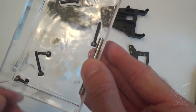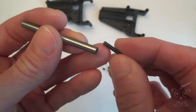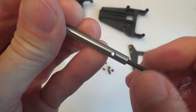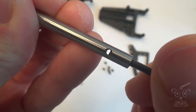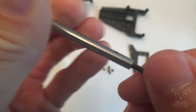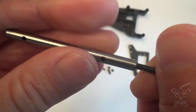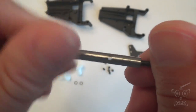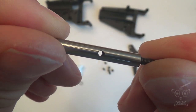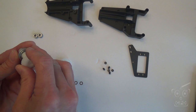I did look at Nick Maxwell's video, so you're going to see some similarities to that when we start getting into setting bevel gears. The one thing I really want to make sure I do on this tail gear shaft is chase those threads all the way down to the holes and make sure there's no burrs or anything in there. There would normally be a set screw, but there's actually a screw that's part of the build that fits just fine — it's an M3 screw. I can just thread this longer screw in and run it all the way through to make sure the screw pokes through the hole and all that metal is cleared out.